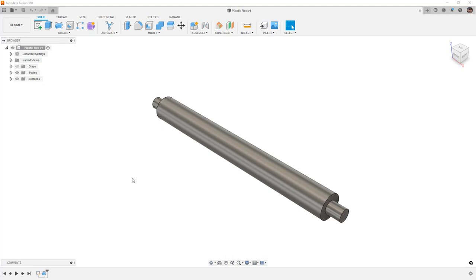In most cases if you're designing a part for manufacture, whether it's 3D printing or CNC machining, you can just make the part you need. However, with plastic part design that's not always the case — you have to come up with creative solutions to ensure consistent wall thickness, draft in the correct directions, and an overall consistent part. With something like this shaft, we're aiming for a two millimeter wall thickness. The shaft is 100 millimeters long with a six millimeter diameter section and a 10 millimeter diameter section. The general idea is we can't just mold this part as is — with the large amount of plastic in the center, as it cools the center will stay molten and the end result will be a shaft with a bow or curve to it. So we need to figure out a way to turn this into a proper plastic part.